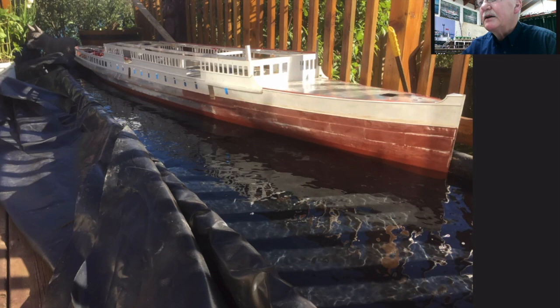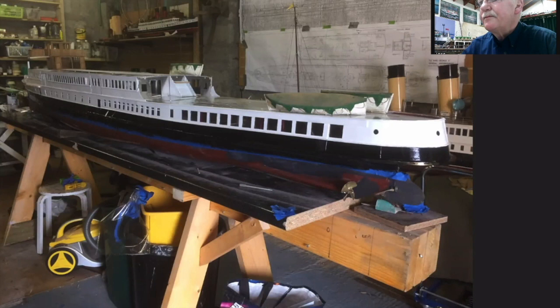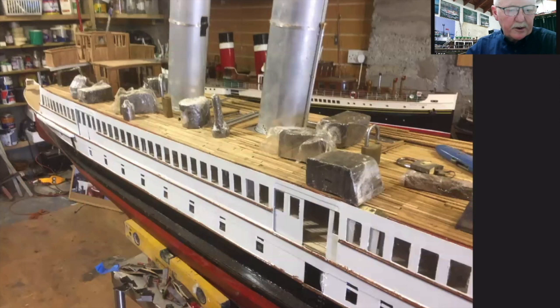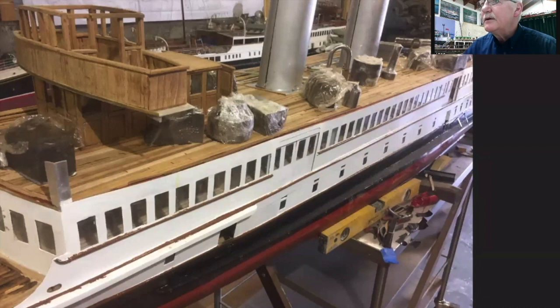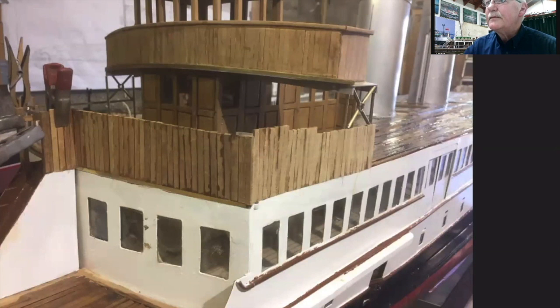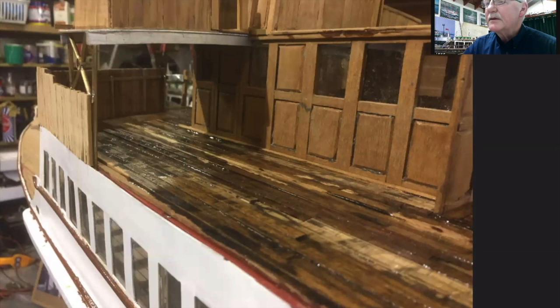First test tank. Funnels going on. The funnels are made from 4-inch aluminium tube, squeezed and vised to an oval shape prior to having oval spacers placed inside, subsequently bolted to the deck. The teak deck going down, the lead weights to hold it till the glue's set. More decking. It's the coloured epoxy prior to sanding.